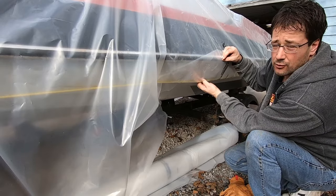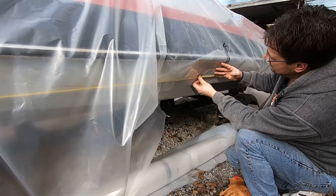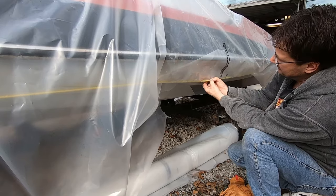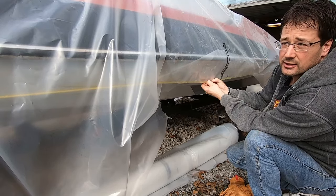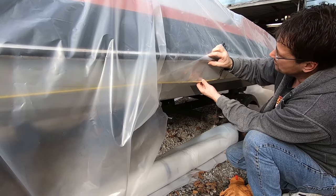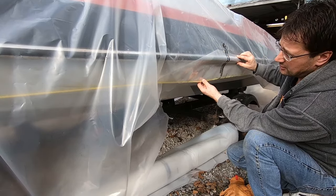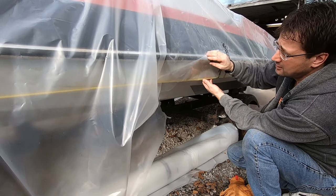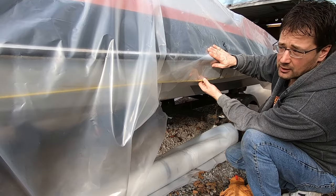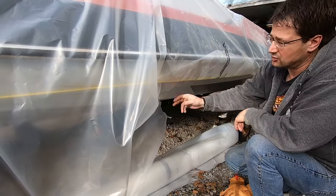and it's away from the rope. I could do it just as easily along here and weld this tight down here, but if that's welded tight, it's going to be very hard next year to get the rope out, and I'd like to reuse the rope again next year. So I'll try to concentrate my welds up here. Of course I'm going to be heating down here, but I'd like to get the majority of the welding done here away from the rope so I can just slide the rope out next year.